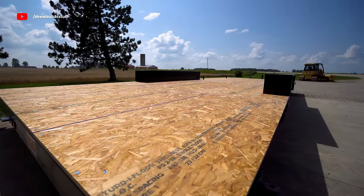And then I'm going to be screwing this into the wall, so I'm measuring out some screw placement just to make it look pretty and precise. And then I'm using a 3/8 inch Forstner bit to countersink these holes about halfway into the board. I just put anywhere from 2 to 4 in each board depending on the length. Now I can just line the edge of this board up with that vertical line I drew, and just trim this piece out.